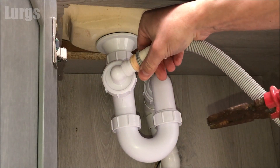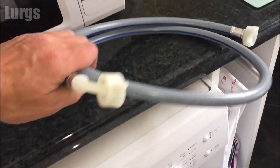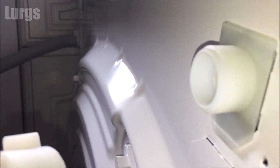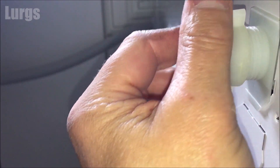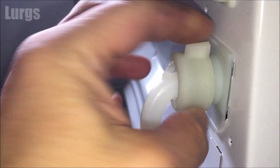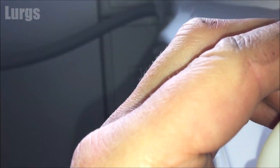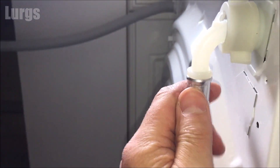Generally most modern properties will have this kind of arrangement underneath the sink. Now we'll connect the cold water feed. The 90-degree angle end of the pipe goes on the washing machine end — screw this on clockwise, make sure you get a good fit. If it feels like it's not going on, don't force it — it should go on nice and easily. Whatever you do, don't be tempted to tighten this up with a ratchet or a pair of pliers. Just do it hand tight — you do not want to damage those plastic threads.